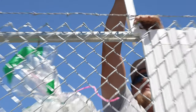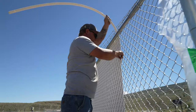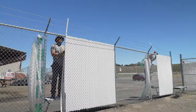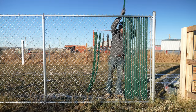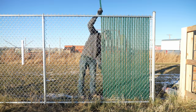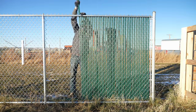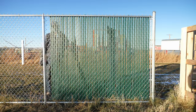Obviously that's going to have an even higher wind load, and I would recommend you put those in a nine gauge fabric. I would also potentially recommend that you shrink your post spacing — instead of going ten foot on center, consider going to nine or eight. That's just another option if you have a chain link fence built with the appropriate materials, or if you're looking to install one, make sure you invest in the right materials to withstand the winds.